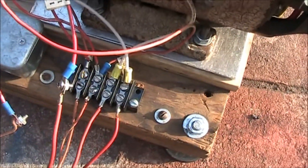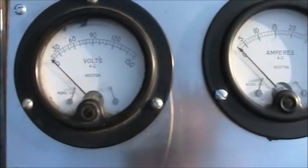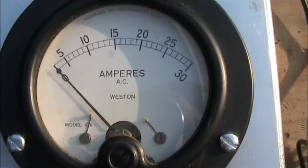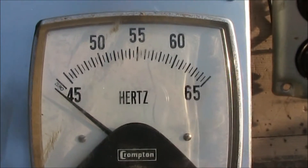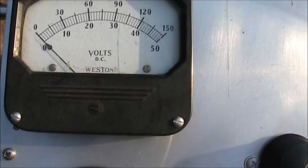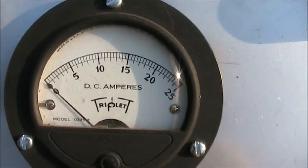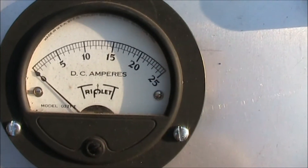There's our terminal block for that. AC power goes to AC voltmeter, AC amps, and frequency meter. On the field supply end, or the field meter side, we have a DC voltmeter — we are reading the lower scale — and DC amps that comes out of the commutator for the field.